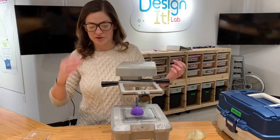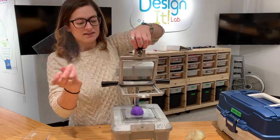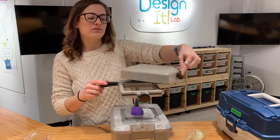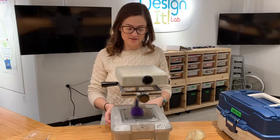That's where the vacuum air is going to suck through. Our next step: we're going to take our sheet of plastic or polystyrene and pop it in the top, close that mouth up — looks nice and snug — and we'll move our heating element over to the front.